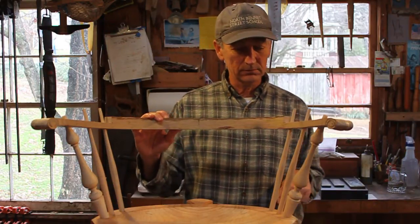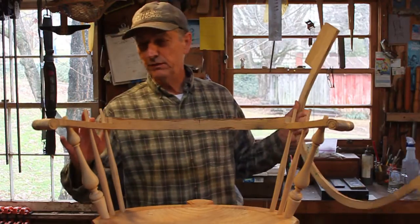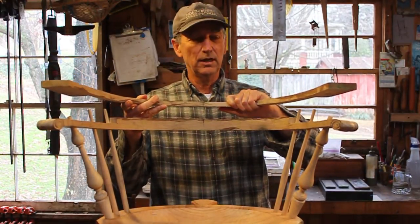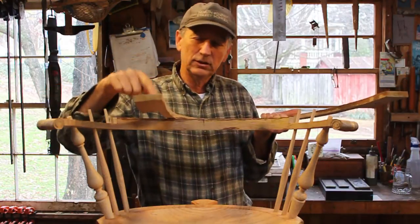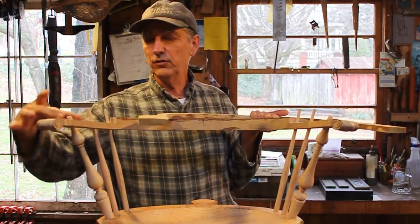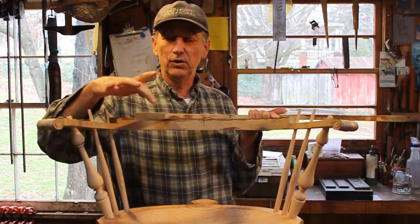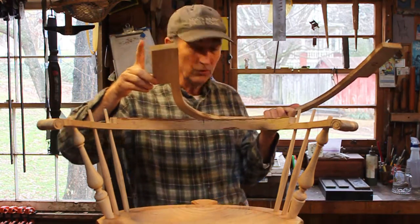But first, I want to back up, because when I originally bent this thing — and I've also bent one that was a thin arm rail, to show you a simpler option — whenever I was laying out and finding the position of this hole right here, I forgot to show you how I do it on this one. It's just a little bit different. On this one, since it's just a knuckle and there's no scroll over here on the side, it really doesn't matter where I place this hole. But over here, because I have a handhold with a scroll on the side, it does. So I'll show you over here the way that I do that.